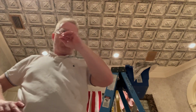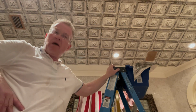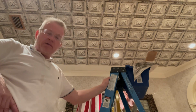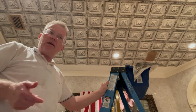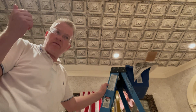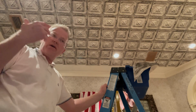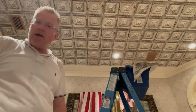What helps when you're working on a ceiling is if you spritz the wallpaper and or the ceiling with water. It buys you time. You're working more slowly because you're working on a ceiling. It's more physically taxing on the body, and consequently, you may not realize it, but you're working at a slower pace. As a result, the water in the paste starts to dry up, and the wall covering consequently becomes more difficult to manage. In order to decelerate the time during which the paste is drying up, add water, and you will buy yourself some time and get a better installation.